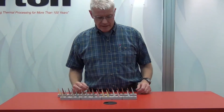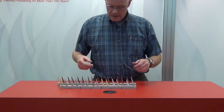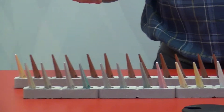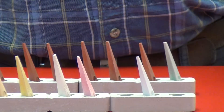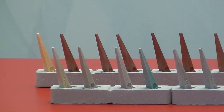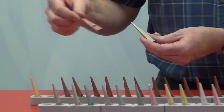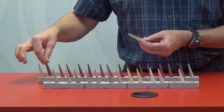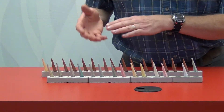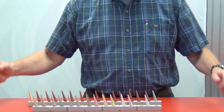We developed a second set of cones that could be used in place of the red cones, and we call that our iron-free series. They are set up between O10 and cone 3 as well, but they do not contain red iron oxide and they are colored in a different shade, so that if you were to see a cone O10 and a red O10 you would know that there would be a difference between the two of them. But they operate at nearly the same temperatures as the regular red series, so you should be easily able to adapt them into your process.